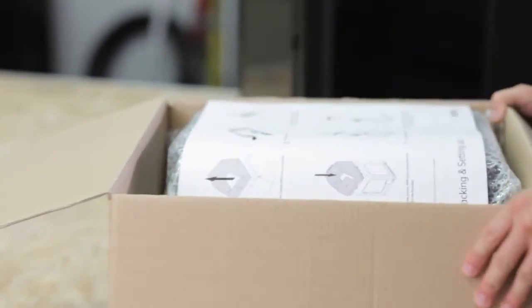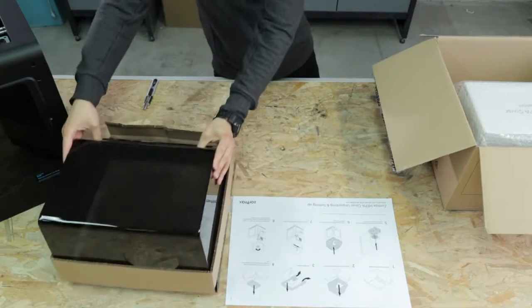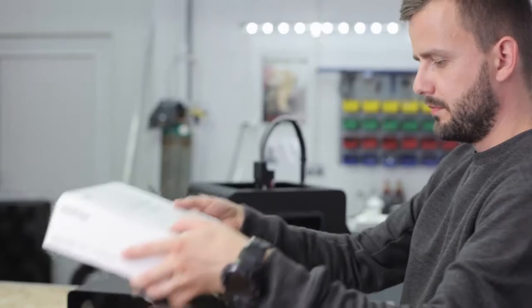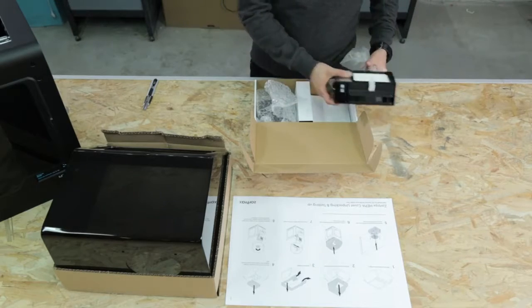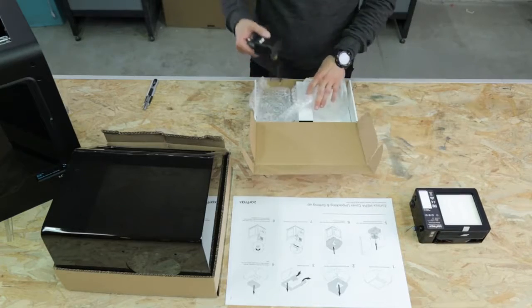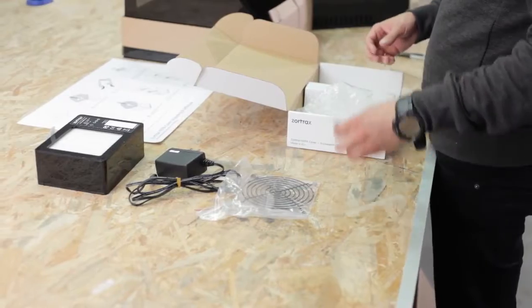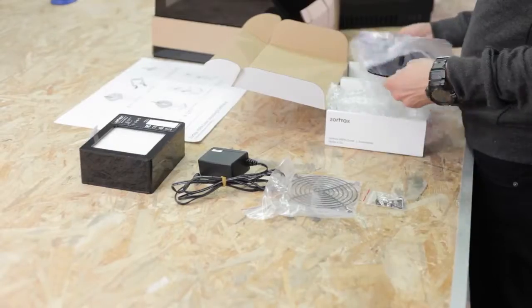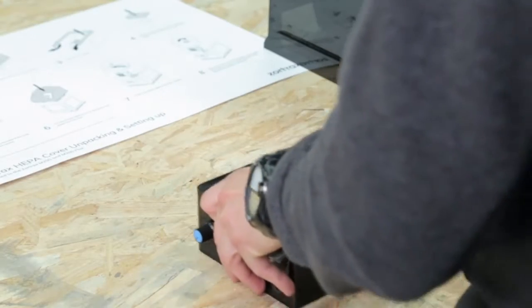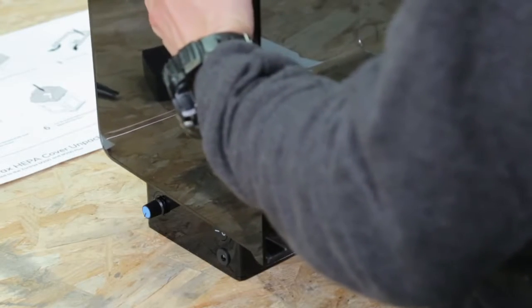The carbon filter inside also gets rid of any unpleasant smells that might occur during 3D printing. This should greatly influence the use of Zortrax 3D printers in an office environment. The regulation of the fan speed not only makes sure that the temperature isn't too high or too low, but it also allows the chamber to heat up more quickly and then to slowly cool off the print, which in essence reduces the highly undesired warping effect.